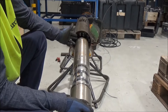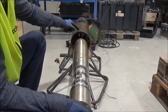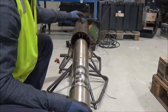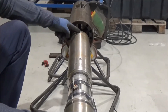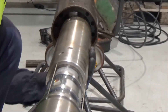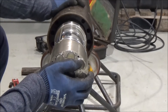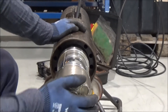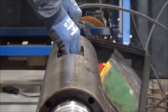Okay, so when you have connected the O-rings to the camera, you will line up the running tool with these grub screws here - these two - with these two here. You will see the mark after the old grub screws. Then just push it in, and watch the umbilical at the top, all the way in. And then you will line the umbilical inside this.